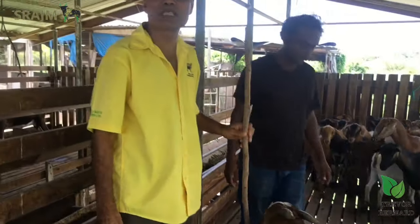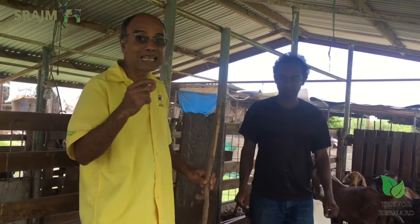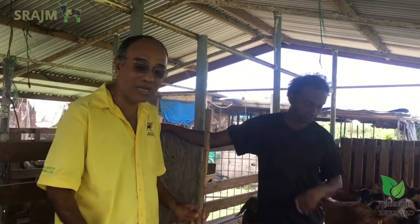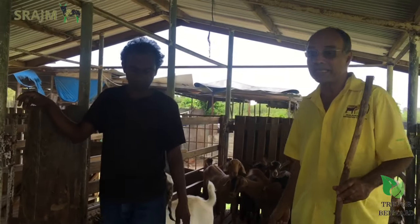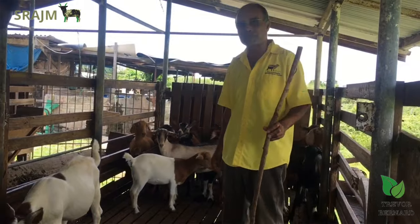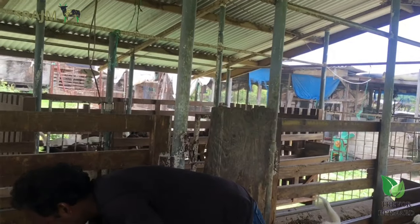Remember, these boards shrink, so maybe a year after installation the space will end up being wider — three-quarter inch, maybe even an inch. We have seen situations where after a long period of time the space becomes one inch and you have to lift up the boards and reinstall them. Bear that in mind when building the pen: install the boards in a way that you can lift them back up and shift them if necessary.